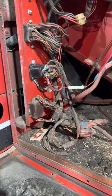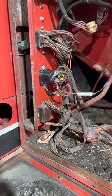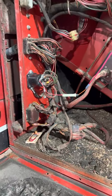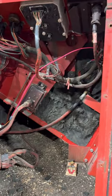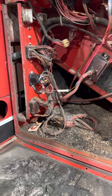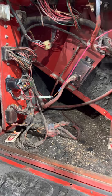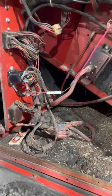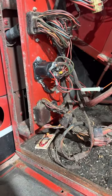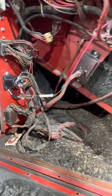After talking to the Case dealer, longevity-wise it seems like the aftermarket ones hold up pretty well. This is an 1980 combine — 1983 — so it's probably not the original solenoid anyway. For the price, we'll see how long we get out of this one. Hopefully this helps if you're fighting some of these issues. Starting with the 14 series the later combines got very electrified, and one little thing can really mess with a lot of different controls. Keep good clean grounds, check for mice damage, and maybe keep a spare solenoid on hand.